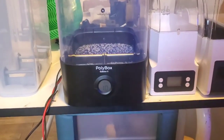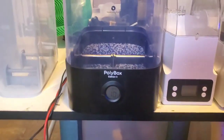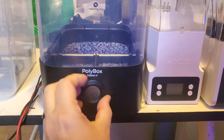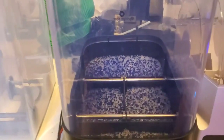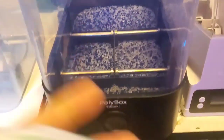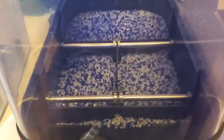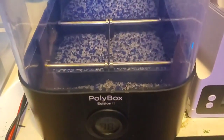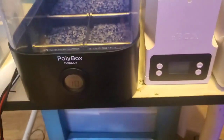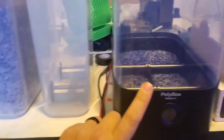The Polybox comes with two bags of desiccant and it is a passive system. It's really just a plastic box with a cheap humidity sensor stuck in the front and a couple of bearing rollers. I've got mine completely filled with desiccant because with the included amount I was only getting down to about 30% relative humidity. With a whole tray full of desiccant in the bottom I get down to about 5% relative humidity. This seems very effective, but only because I filled it with desiccant, which you can obtain a lot cheaper than these boxes.